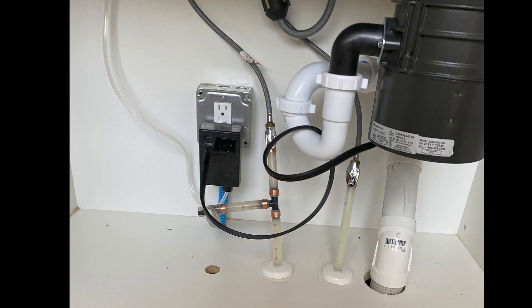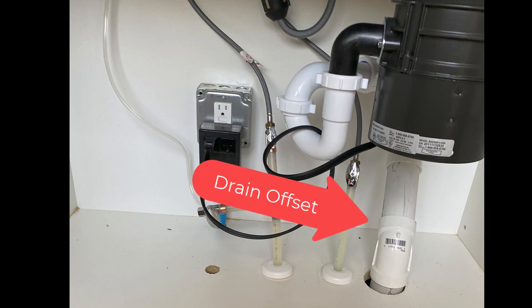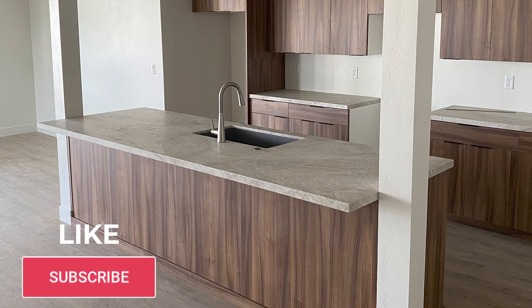Test for leaks. One last thing — if your pipe coming up through the cabinet is not in the right place, you can offset it back. Here I've used a couple of 45-degree fittings to angle the pipe to the back of the cabinet, and then I've hooked up the sanitary tee behind the disposal. Good luck as you install an auto vent — make sure to like and subscribe.